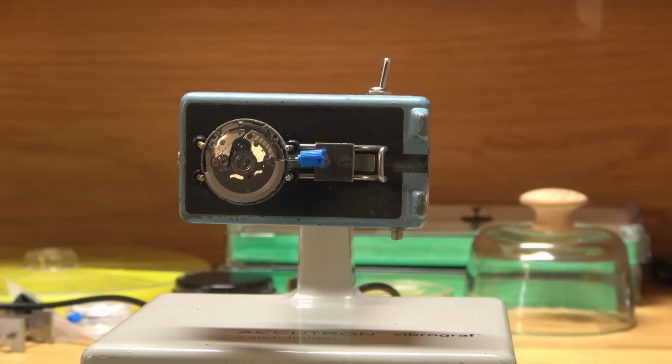This is very important because the real crown right is usually the weakest position of all the positions, because unless you're talking about a high-end movement, manufacturers hide the natural faults of the escapement in crown right. So that's typically going to be your worst position. And since probably the two most important positions to most people are going to be dial up and crown left, you want to make sure that you're looking at crown left properly.